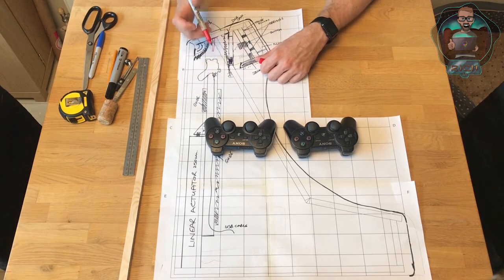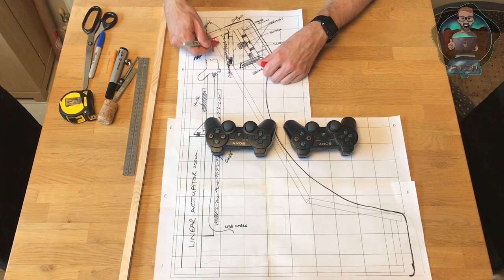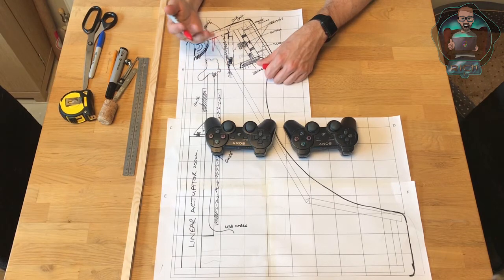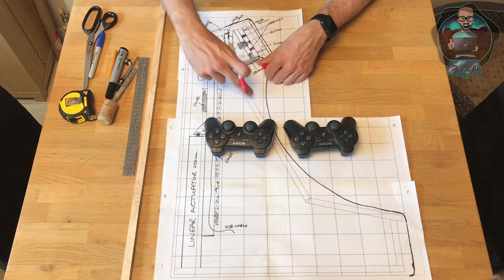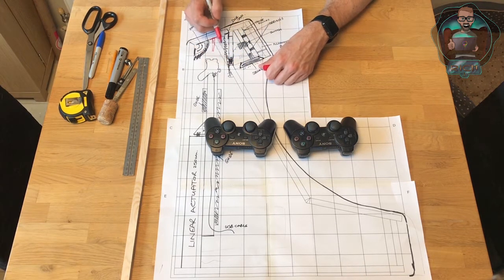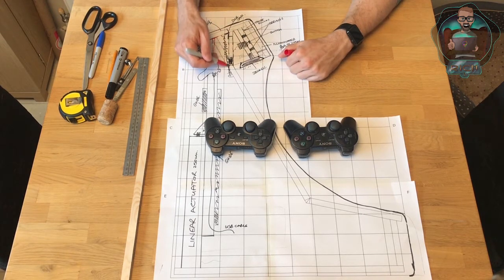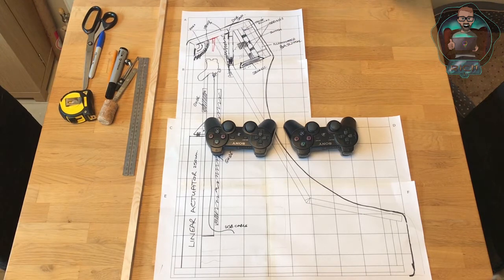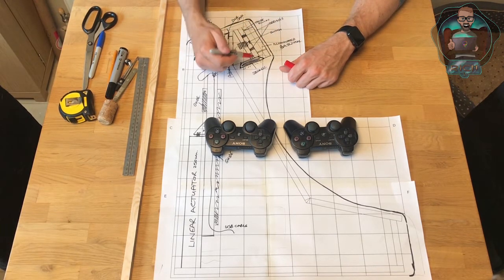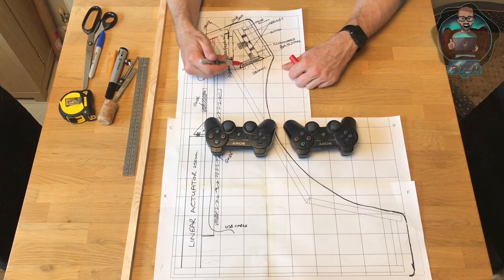To create the space for the carriage, where the marquee would normally come straight up, this section needs to create an angle to give us the void for the carriage. It's not massively difficult, just slightly more complicated — the piece will finish short and then come straight up vertically. The flap will have a spring on either side to keep it closed, plus two concealed hinges on the inside.